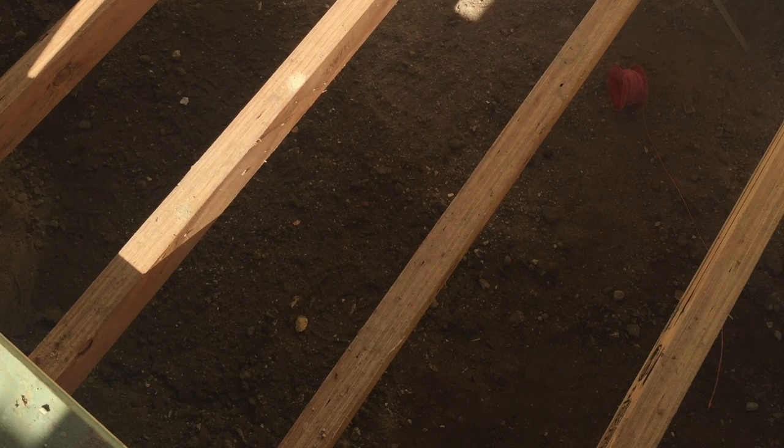Timber floor there. We have a timber floor there because the existing footing is a sandstone footing, so the engineer didn't want us excavating too close to that because of the existing house. Okay. And it's pretty much all on clay. It seems to be holding up all right for the last 100 years.